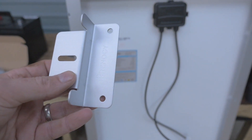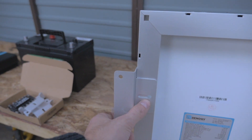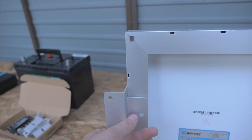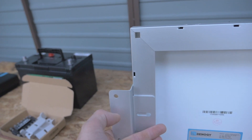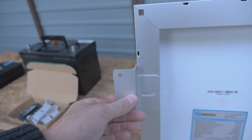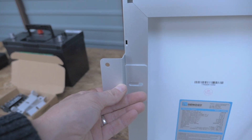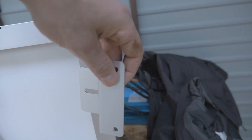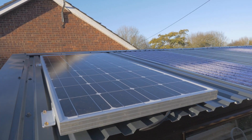As you can see, we've got these brackets. We need to present these onto the side here so we can screw them down. I need to measure between that hole there and the other side. I'll drill this first set in here, attach the solar panel to it, then work out the distance to attach the second one afterwards and drill that one. I've brought the cables in from outside and they now run down this panel here, ready to connect to the MPPT controller in a moment.